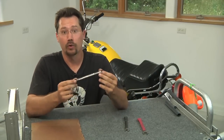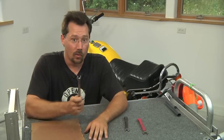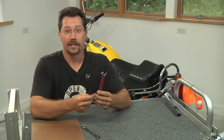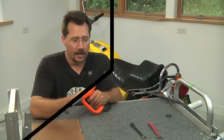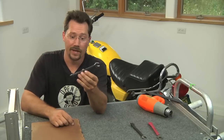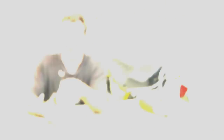A typical wrench is an excellent way to short circuit the two power posts on a battery — we don't want to do that. So what I did was I took the wrenches I'd be using specifically for the batteries and insulated them with heat shrink. Now we have a wrench that is much less likely to short circuit a battery.